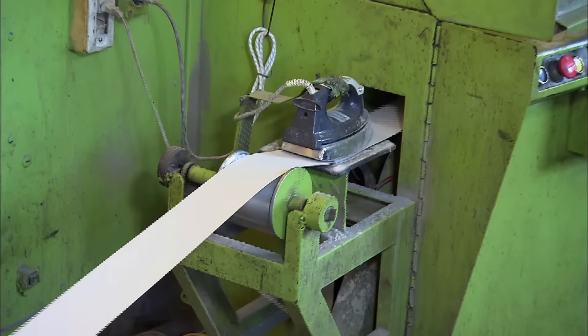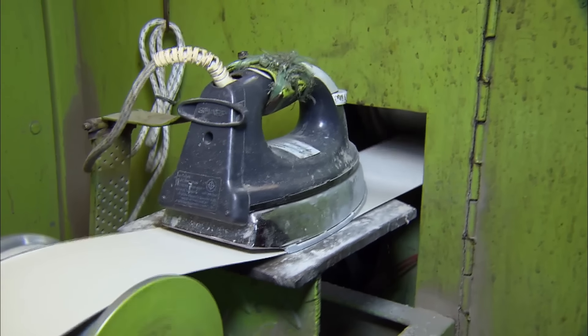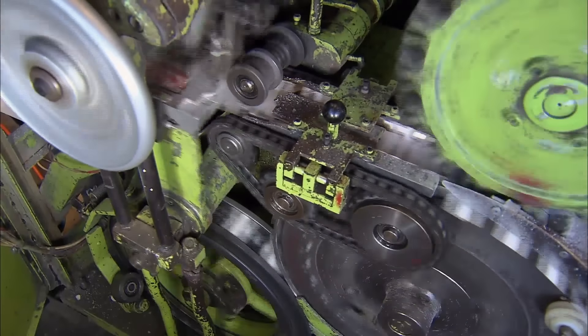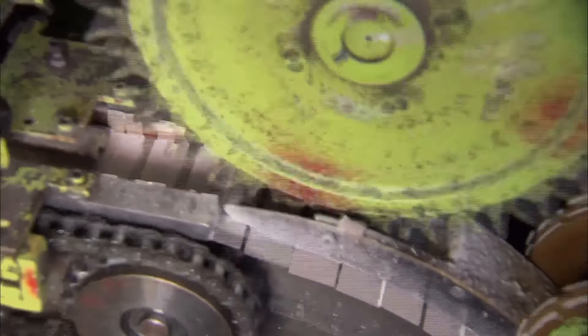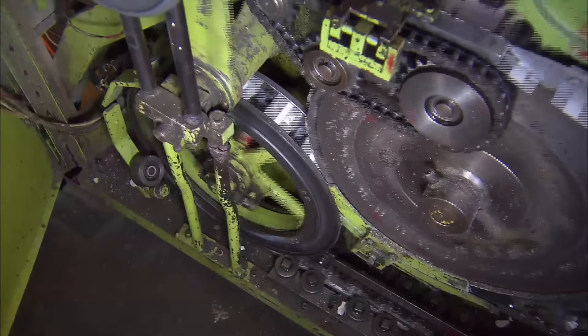Today matches are cheap and easy to make. A liner board paper roll feeds into a machine, passing under a hot iron to reduce the moisture level to around 5%. An inner box making machine like this one can make 55,000 liners per hour, through high speed die cutting, folding, gluing and forming. The speed of the process depends on the inner box's size and the paper's density.